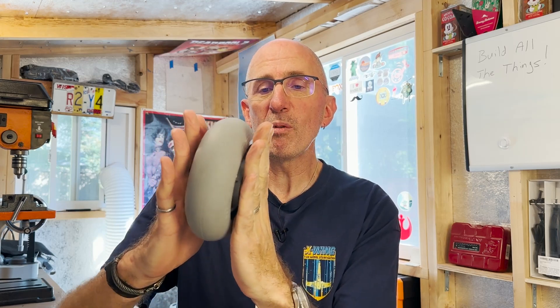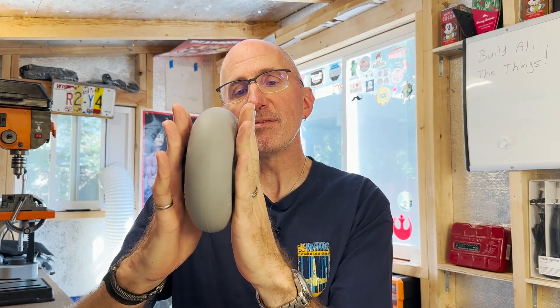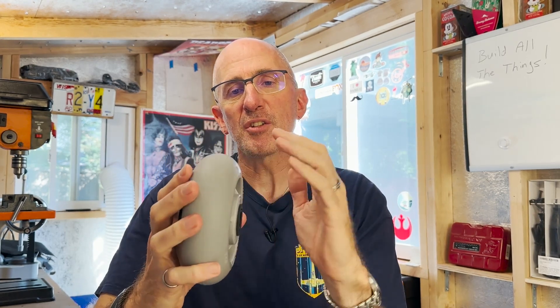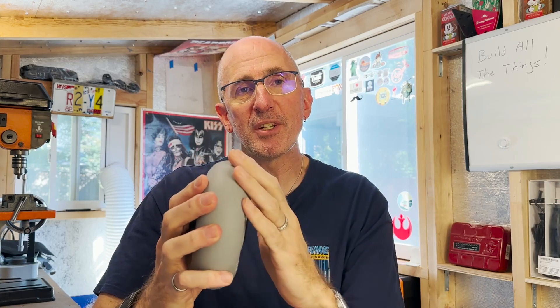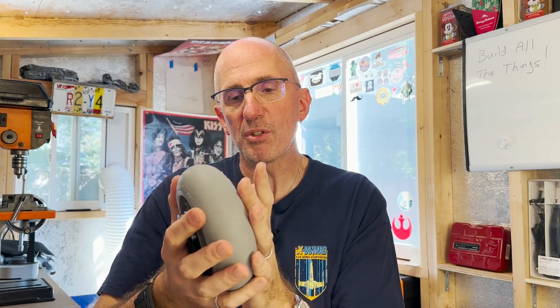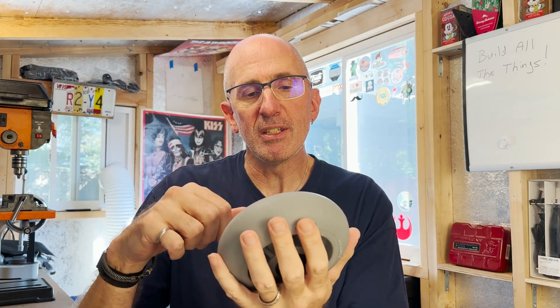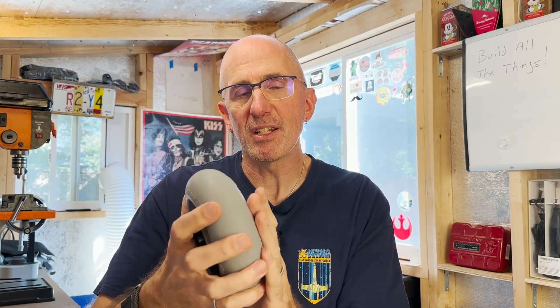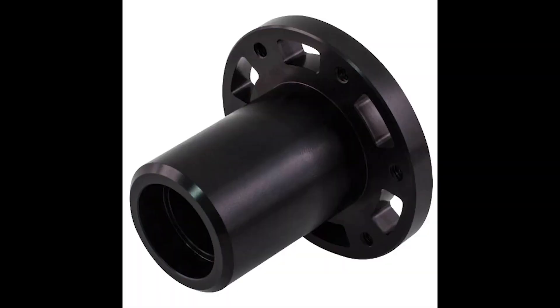In my current design, when it banks, the wheel will actually do a little bit of deflection — it will actually tilt a little bit. So I wanted a wheel that had a rounded top, not flat, and so this was the wheel I chose. I'll link all the different parts and everything in the description. A second reason I chose Colson is that a company called Vex Robotics makes hubs that fit with Colson wheels.